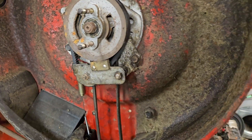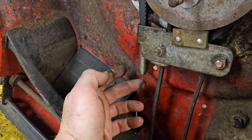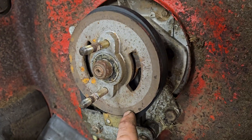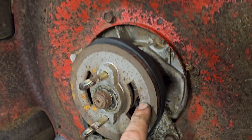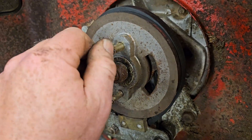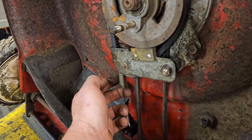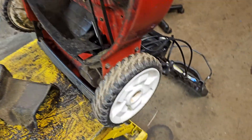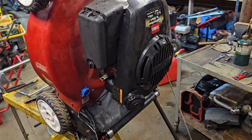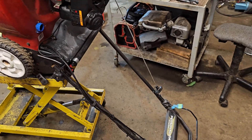When it's running, the vibrations and everything make this a little bit smoother. When the video is over and I throw this back together I'll fire this thing up and show you how it engages and disengages. I've had to replace these cables — they tear. I've had this pulley seize up, this pivot seize up, this belt wear out. Never actually had these sheaves wear out — there's a bearing in the bottom one and I think in the top one as well. Anyway, that's how a Toro BBC blade clutch system works. Subscribe and hit the notification bell so you get more videos like this. Thanks for watching.